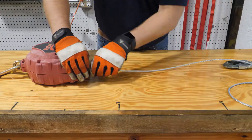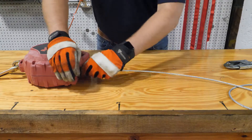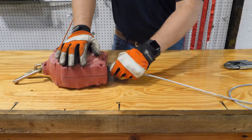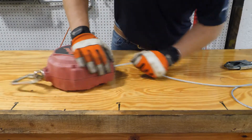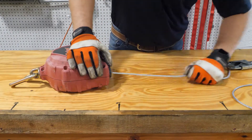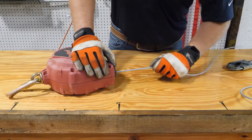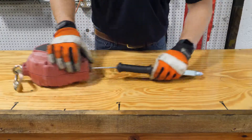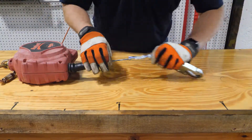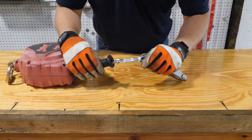When you reach the end of the cable, let it back into the housing. Pull quickly on the cable every couple of feet to engage the brake — it needs to be pulled out pretty fast to replicate a fall. Finally, pull back the rubber handle and check the swage points to make sure the cable hasn't moved from its original position.